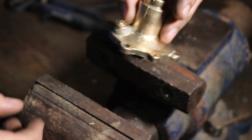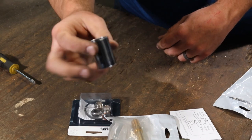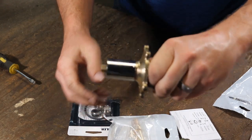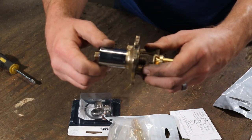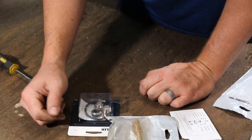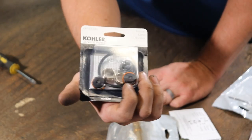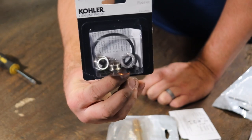Next we're going to screw that yoke assembly on it. Here it is. And the new little trim piece just pushes on and slides on — just like that, brand new. If you guys have any questions, comment down below, make sure you subscribe. I have videos like this all the time about different plumbing stuff to help you out. I'm going to put links in the description to give you each and every part you need to rebuild this. They also have a rubber parts kit — the GP 30090 — which comes with just the washers. If you feel like everything's in good shape, you can put new washers, packing, and seats in it. All the links will be in the description. Thanks a lot guys for watching — I appreciate everything you do.